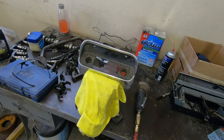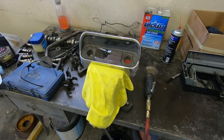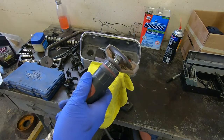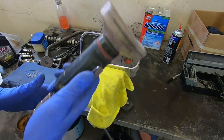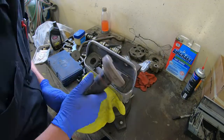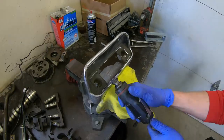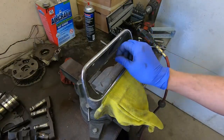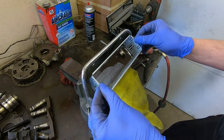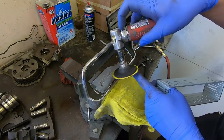So now we just need to get the die grinder. We're setting up a vise to start doing some cutting. Don't forget to get your nice car out of the way, and don't forget to wear your safety glasses. We're going to use a thin disc cutoff wheel here and make some cuts.